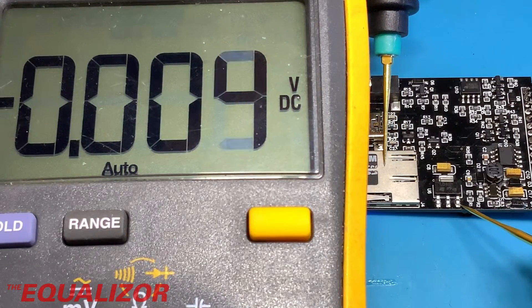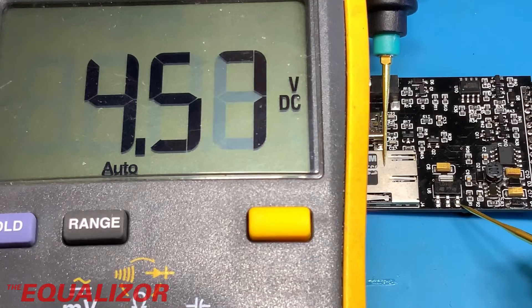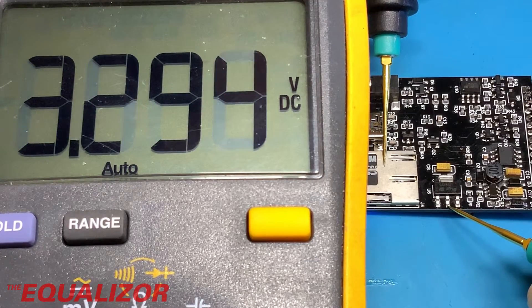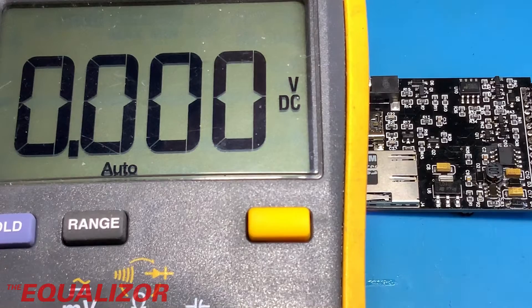This is what this should do when you plug it in — you get a nice little light to show up there. That's not happening at all when you connect it to 12 volts on a power supply. So while we've got it plugged in via USB, let's check those voltages on that voltage regulator. It's showing 4.57 volts on the input — that's absolutely fine — and 3.2 volts on the output. The reason the voltage is a little bit lower is because the USB is going through a diode, and obviously that's dropping the voltage a little bit.